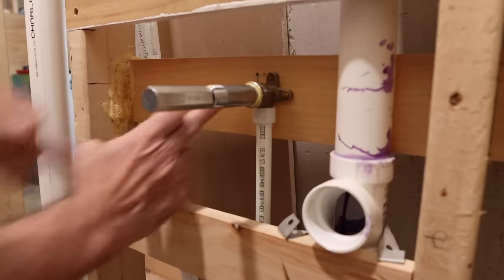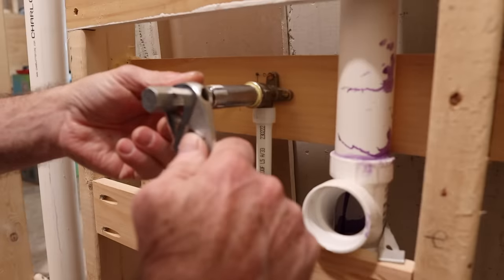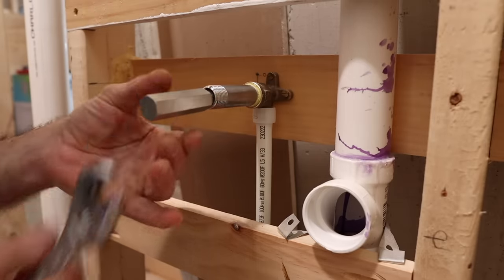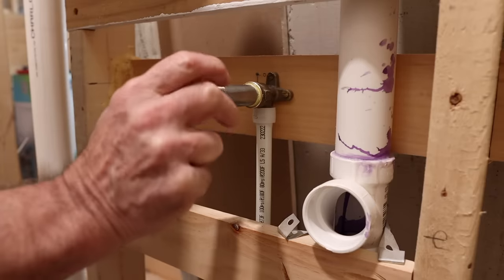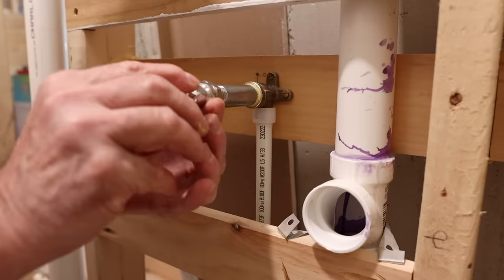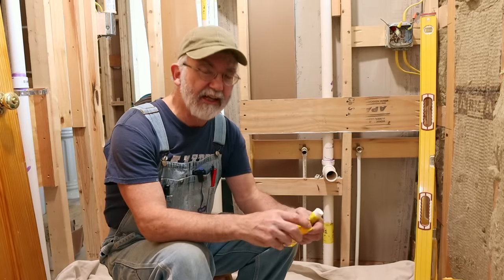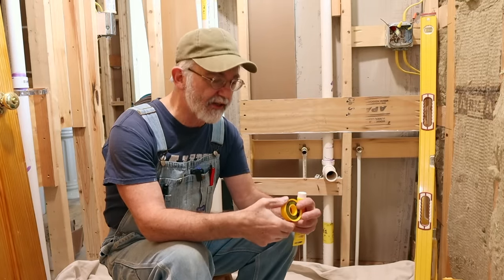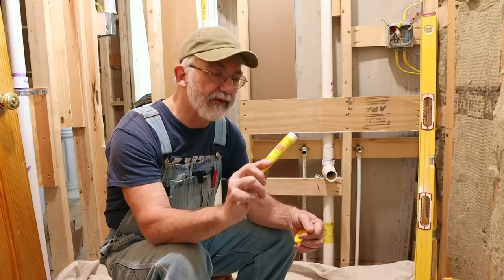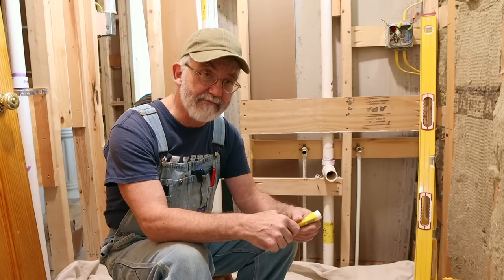See how I've wiped that off? How nice that looks. We're going to have just enough room for an escutcheon. And then after the drywall's on, we're going to thread on a stop — a right angle stop like that. I guarantee you're not going to have any threaded pipe connections that leak if you use good quality Teflon tape, good quality fresh pipe dope. If the old stuff isn't what it should be anymore, just like I showed you — it's going to work every time, no fail.